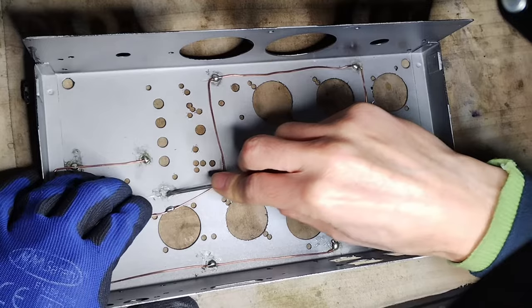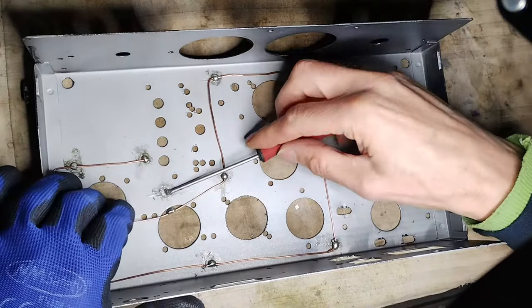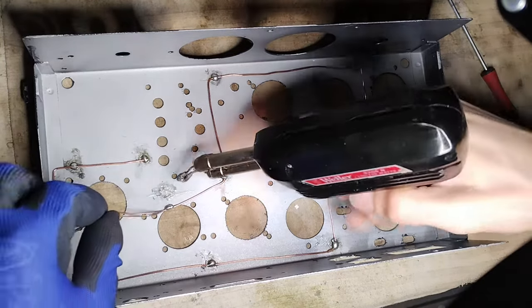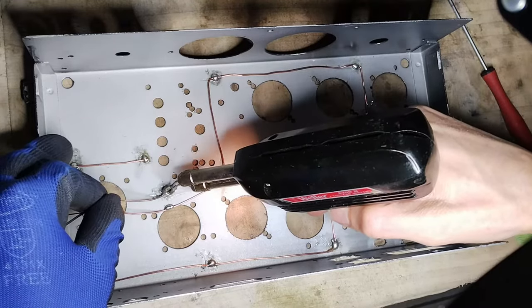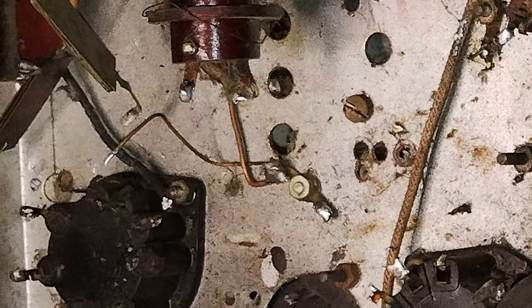After soaking in acid, the chassis has been cleaned and then sprayed with a zinc paint. This was also the original condition of this chassis, which came out of the factory with the same simple treatment. In the original construction of this radio, there were no direct soldering points on the chassis but only a few anchors attached with screws.